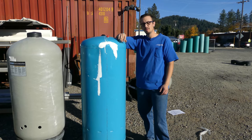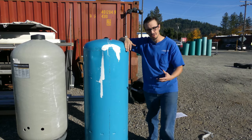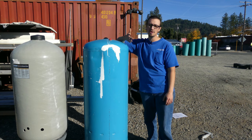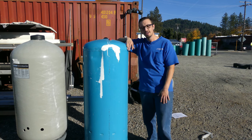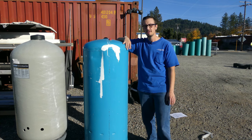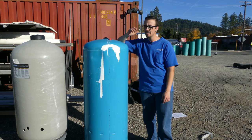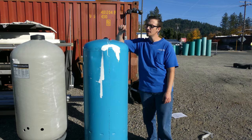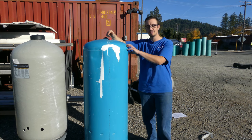So back to the question, how long does a pressure tank last? Generally, if serviced regularly and you don't have terrible water conditions, you can expect a pressure tank to last anywhere from 10 to 15 years on average. I've seen tanks last 20 to 30 years, and I've seen tanks that only last a couple years. So the conditions have to be right, applied properly — not too much pressure, not too little pressure — the appropriate pressure in the operating of the pump system, as well as in the setting of the tank.